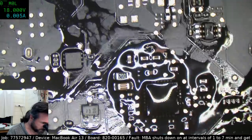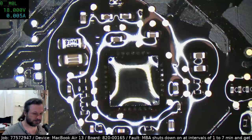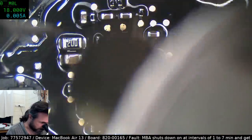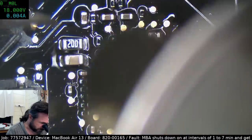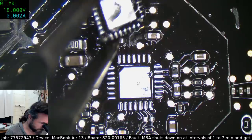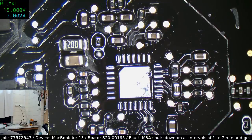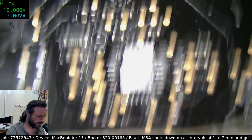Orientation is correct. Pins are clear. I don't have any shorts. I'm wearing pants at the moment. Bad ISL, maybe. Either that or we have induced a full failure of whatever was before a partial failure. I mean, look at those solder joints, they're perfect. There was absolutely nothing wrong with that solder job, even if I am saying so myself. The only thing I can possibly think is that ISL was already soldered on from a prior job onto that board.